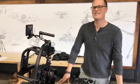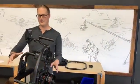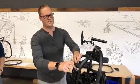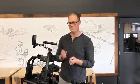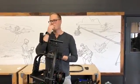Anything else? How much quicker does the Movi Pro get to the required satellites for tracking with 2 GPS? Well, it's only using 1 GPS at a time. The purpose of the GPS is that you can mount it in gimbal down or gimbal up mode and get adequate reception. So there's a GPS antenna here and one there. What I will say is the Movi Pro uses the next generation GPS module from the original Movi, so we are seeing higher satellite count and faster cold acquisition time. That's been a nice performance boost that we got just from the newer module that u-blox has released.